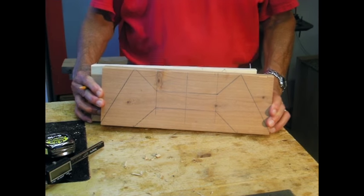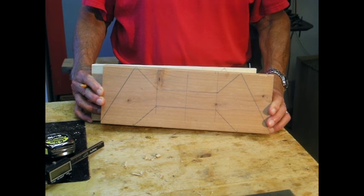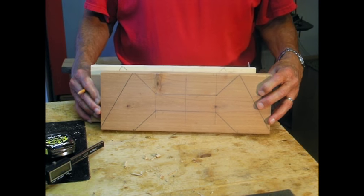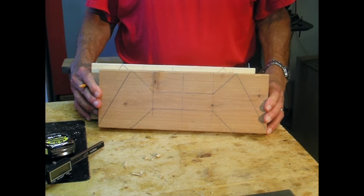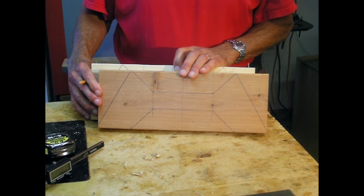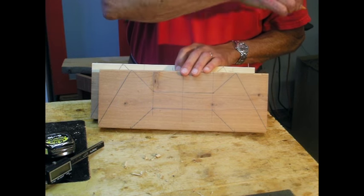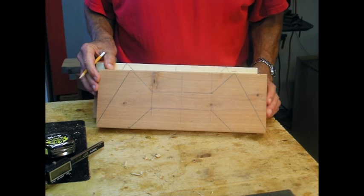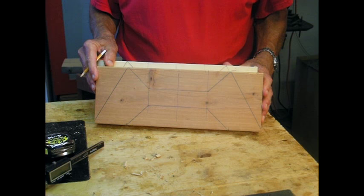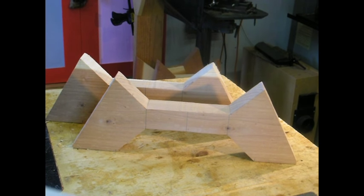The lower crossbar goes a bit quicker and follows the established pattern. Here's what we've built so far — we're almost there. Before moving to the final assembly of the high stand planter, let's cut out the low stand parts. Only two are needed and they are made from the same 2x6 redwood stock as the high stand. Details are provided at the end of the video with all the other planter dimensions. Here is what the final planter looks like if you have chosen the short stand version. My personal preference is the taller stand because I don't have to bend over when using it, but a low planter would be preferable for many patio situations.